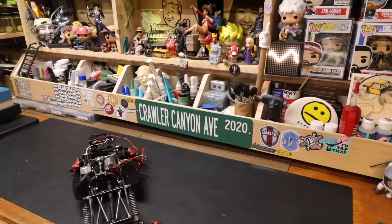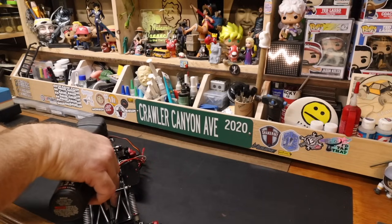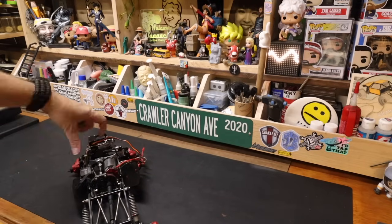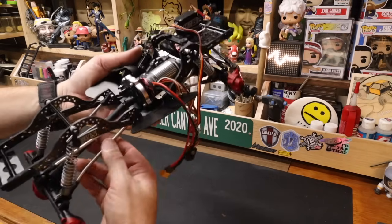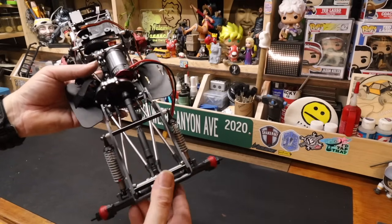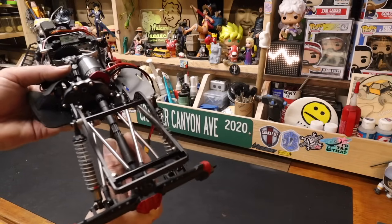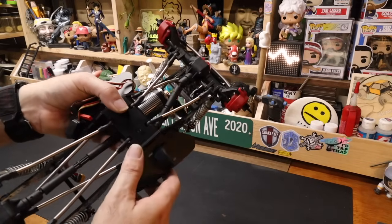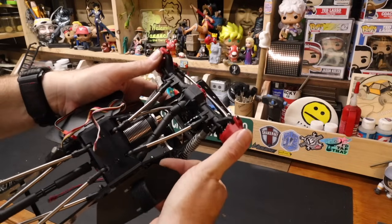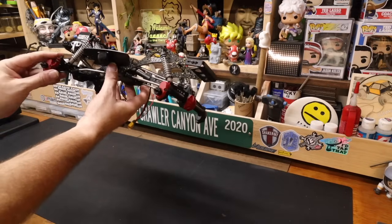That motor, I can almost guarantee that the motor is going to rotate in the incorrect direction, because the vehicle that it came out of before was non-portaled, but that motor was, it might be right. So this is not an excessive amount of exposed shaft, but you can see, because we have so little pinion angle change, we don't need that amount. It's still okay. The front is more where I like to be. See how there's a little, tiny little bit of spline showing? If we can fully compress without binding, then we're good. This guy with so little change, and he's basically built to, well, we'll see.